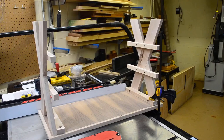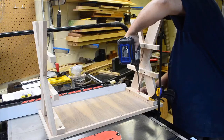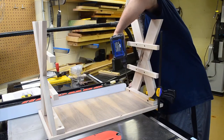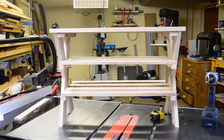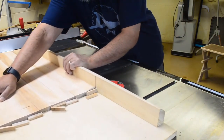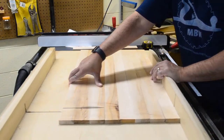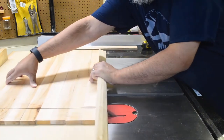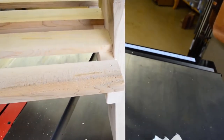To attach the legs at the top, I flip it over and then use a square to inset them to the desired dimension. Once it's in place, I use a clamp to hold it in position while I drive the screws in place. At this point, the only thing left to do is to attach the slats for the shelves. Because I always anticipate I'm going to mess up some important dimension, I opted to wait to cut the slats until I knew for certain the length I'd be needing for them. So once the legs were in position, I measured the length and then set up the table saw for a couple more cuts — the first one to square one end and the second to cut the final length. To attach the supports themselves, I simply fired up my brad nailer and attached them, and here's the final look.